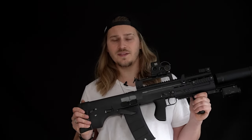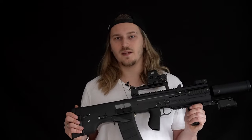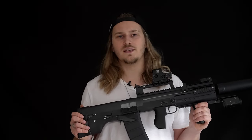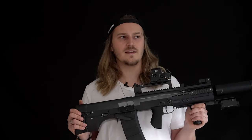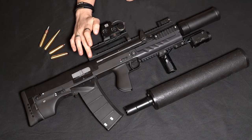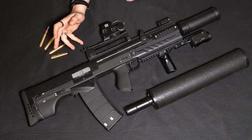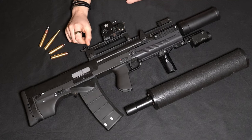I knew on what engine I wanted to build this gun on. From here on out I just started programming and 3D modeling, prototyping and whatnot, and this process took roughly two years. I then pretty much 3D printed the complete gun to verify its sizing and dimensions. Then it was time to start the actual manufacturing and I began with the upper receiver. I took a piece of sheet metal, cut it to size, measured and marked out all the holes that needed to be done, and cut and drilled them out.